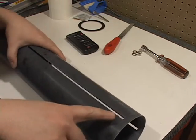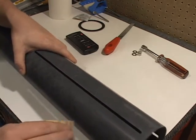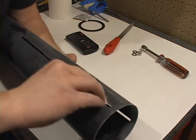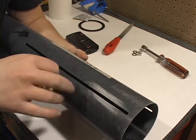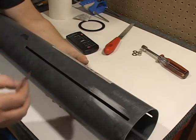Give yourself about a half inch on each side of the fins on the inside as well as the outside. You can quickly see the difference between sanded versus non-sanded. Make sure that's taken all the way down the fin on the outside as well as the inside.